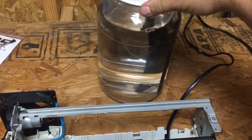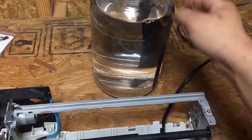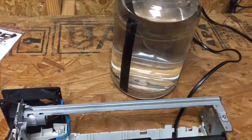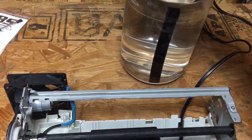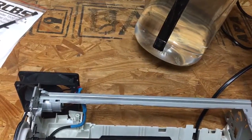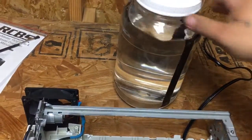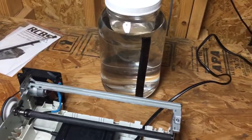I glued three strips of 1/4 inch thick rubber strips inside. Crazy glued it. Seems to be holding in there quite well. That's to help agitate the brass as it spins. Should be good for my reloading needs.